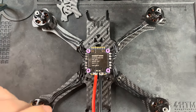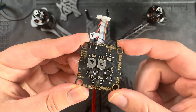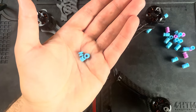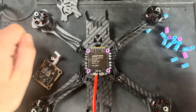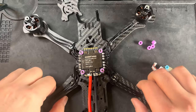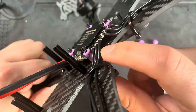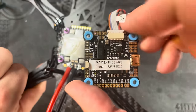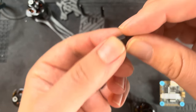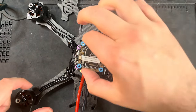Now let's focus on the flight controller. The ESC is all set. Before plugging in the FC, let's get some grommets installed using the dental floss trick — I'll use the thinner blue ones. Turns out the screws aren't long enough with the grommets, so I'll screw on some little standoff extensions that will let us put the flight controller right on top.